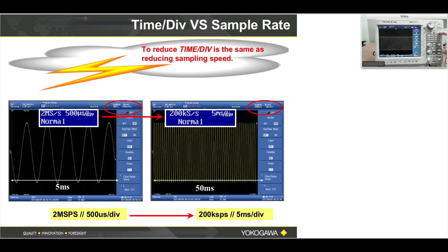Please press the Acquire button. You will see the first soft menu button says Record Length — you can adjust this. Adjust it up and down and watch your sample rate adjust itself to compensate. When you're done, please adjust Record Length to 10K, which is 10,000. There are only two ways to adjust your sample rate: the first method is adjusting time per division using this knob, and the only other way is to adjust Record Length under the Acquire menu. When you adjust Record Length there, it changes the record length shown on the screen.